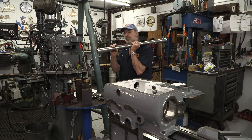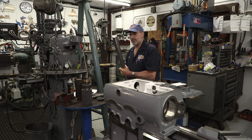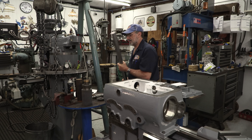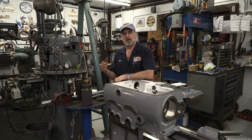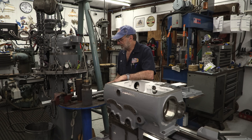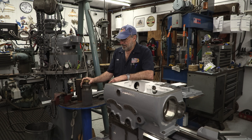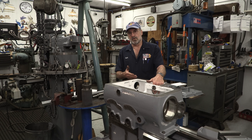This is a piece of 4130 and that's what I chose to make my spline shaft out of. I've got a couple of parts I can go ahead and cut out of this. I will be making probably two shafts at one time, so if I have any issues along the way or I get one that fits a little better than the other, then we put that one in. On the same line of thinking, that takes care of that lower shaft.